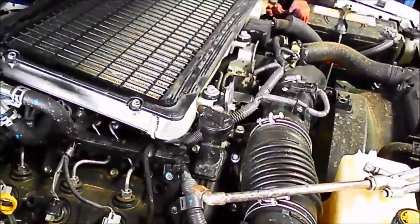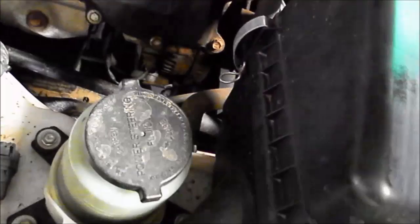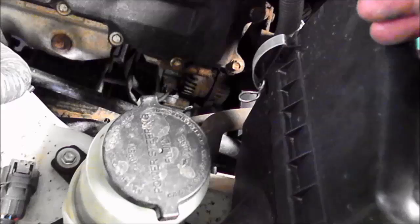The intercooler filter — we'll probably just blow it out if there are a few grasshoppers in there. Then we'll proceed with the power steering as well. Power steering, because it's hydraulic and like an automatic transmission, you check the oil level when it's at operating temperature, because the oil will expand a little bit and with the motor running you know that all the oil is in all the little places where it should be. You can also top up the washer bottle.